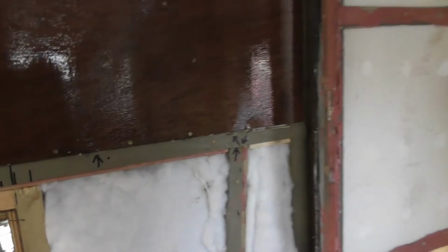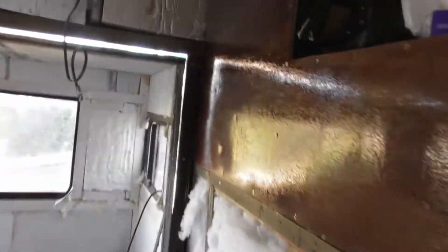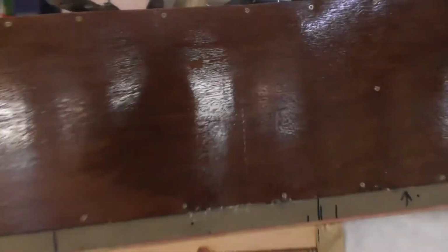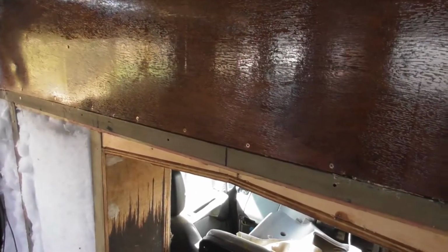As soon as he's been, I can shut the door properly and carry on doing what we're doing. But yeah, this panel has actually come out quite good. As I keep saying, we've got open grain everywhere, and there's just not a lot I can do about that unless I hand brush it. If I was to hand brush it, that would go, but because I sprayed it, it hasn't fallen into the grooves like a brush would do. I didn't want runs and lines everywhere with a brush.